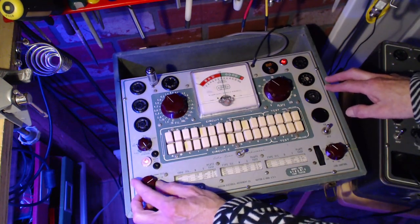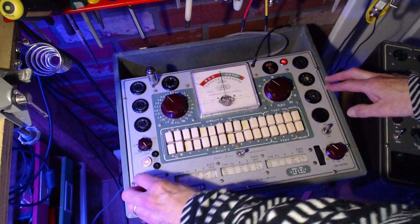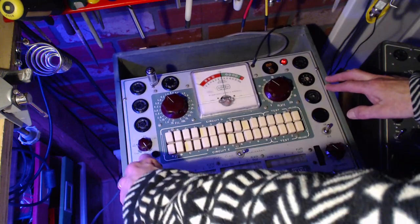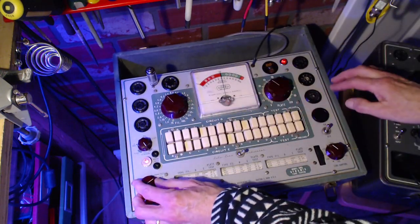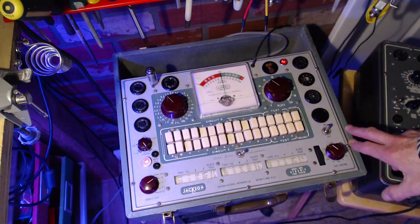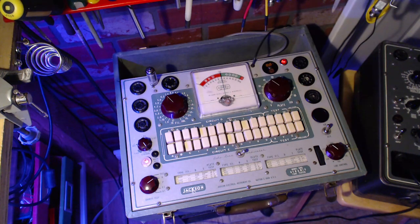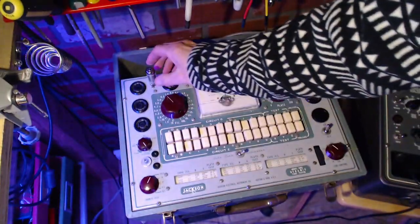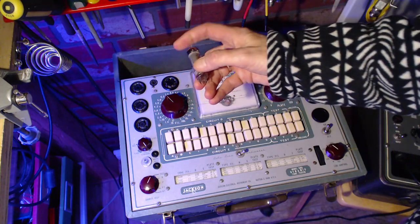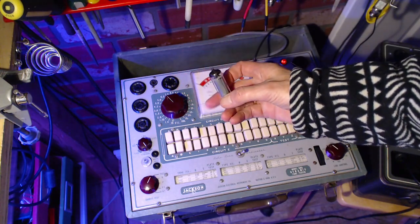Oh my gosh, now a short is showing up. Why didn't that show up earlier? Because the tube was not in the socket quite right. So we've gone from a 6AQ5 bad substitution for a tube to a bad 6AQ5, a really bad substitution for that tube. What happens if I get a good 6AQ5 and stick it in there?